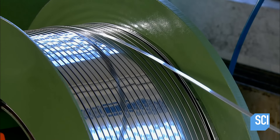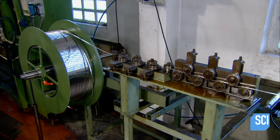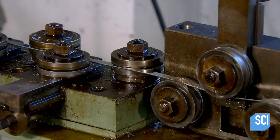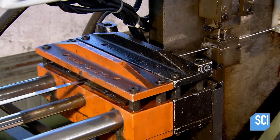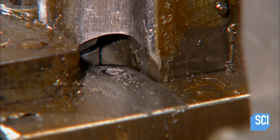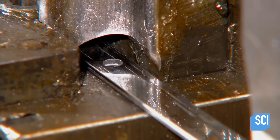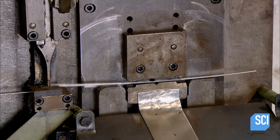Another model has a built-in tray to collect the grated food. This machine forms the pivoting handle, which enables the blade to stand upright in the tray. First, the machine cuts a strip of stainless steel to the required length, makes holes for a rivet on each side, then bends the piece to a U-shape.